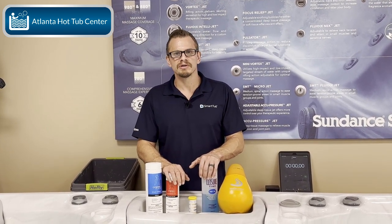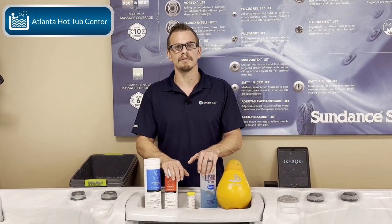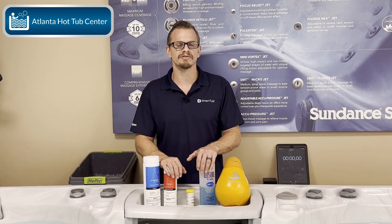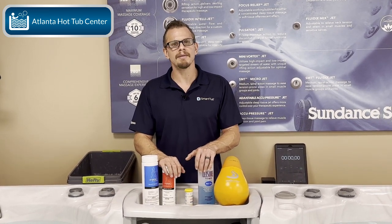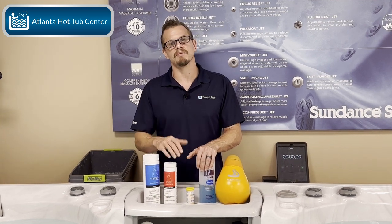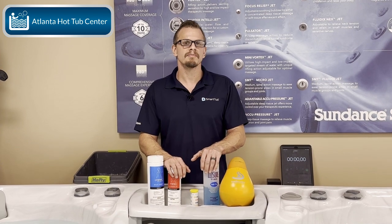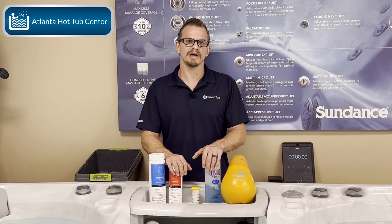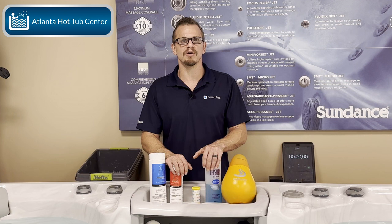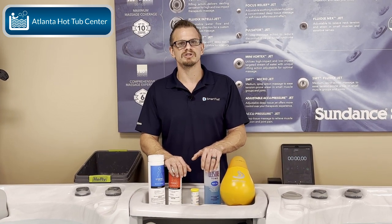Shock oxidizer, sanitizers and such, they bring down pH levels in your hot tub. Getting in and out brings down pH levels in your hot tub. So it is a common practice to have to bring your pH levels up. If you continue to have a problem with your pH and you're having to do it more than once a week, you need to purchase a product called pH Balance Plus. You add a few tablespoons of that every single week and it will keep your pH levels in the ideal range so you're not having to adjust them often.